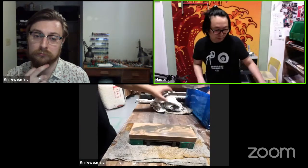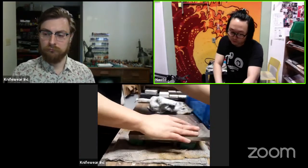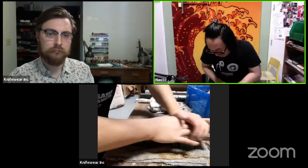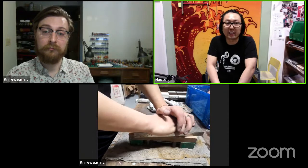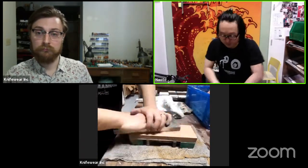But yeah, something that you have to be careful about. I've seen lots of knife makers, sharpeners, polishers, even from Japan, in certain parts of Japan, like to use stones that actually spark a lot. Heat is not the greatest thing for the knives. Those knives are usually quenched, but also tempered at a lower temperature, like 150 to 200 degrees. That's Celsius. So 180 is like a 350 degree oven, which isn't that hard to attain, I guess. Even some amateur knife makers just put the knife in the oven to temper after quench.